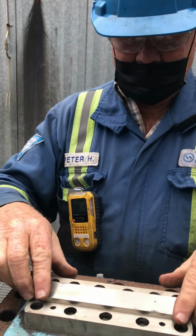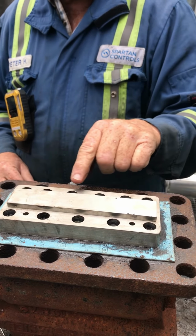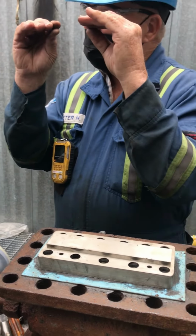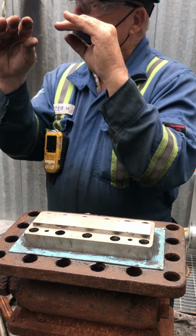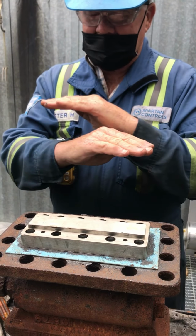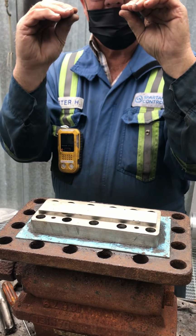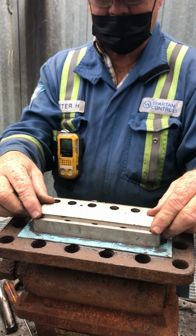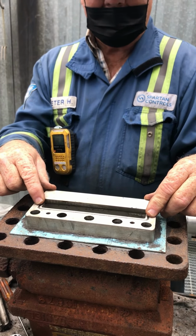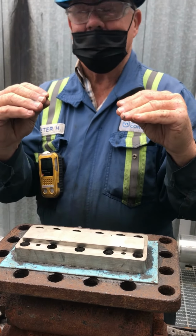So if you have that little gap there, because this is tight here, you're expecting the grease to plug that. And sometimes the grease doesn't. There's so much pressure it's pushing through there. By rights, if this is perfectly flat, machined, everything's bang on, you don't need the grease. Metal to metal, it'll seal. But the grease is on there because when it moves back and forth, it doesn't gnarl and scrape and tear up each other.